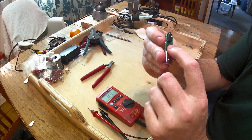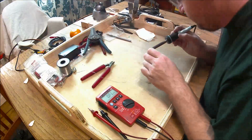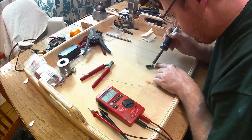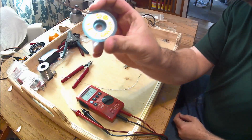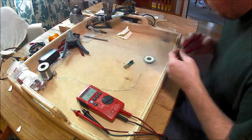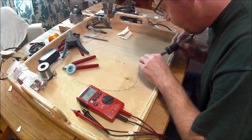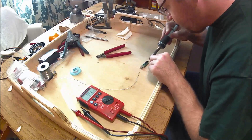This allowed me to pop them off and then go after them with a soldering iron — two little resistors there. So what I'll do now here is just get my iron ready and dab a little solder onto them, kind of wipe them off with the tip, the last little pieces that are attaching to the lands on the board. Then I got my solder wick and I want to clean off those pads, so I went after them with a little bit of solder wick. A little piece of solder wick like that does get pretty hot!